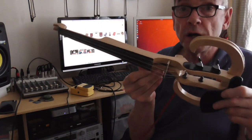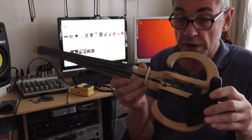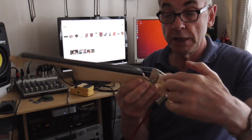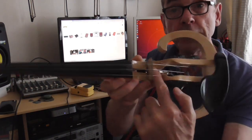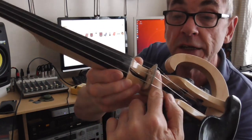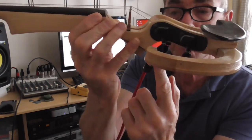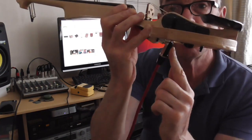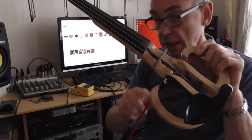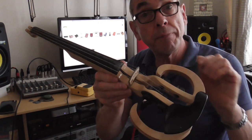So this is my typical passive instrument. It's got no built-in effects or electronics — it's just purely got a piezo strip underneath the bridge there. I got that from eBay, stuck it underneath this bridge. And that's fed purely to a quarter-inch jack coming out of here, going into my mixing desk. I'll be back in a moment and I'll plug it in.